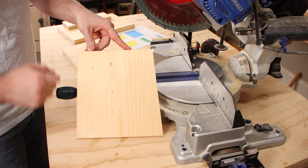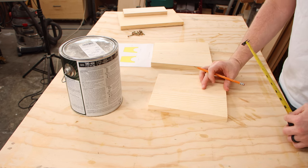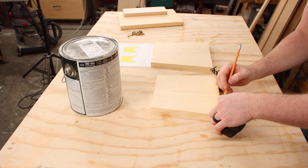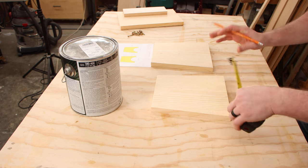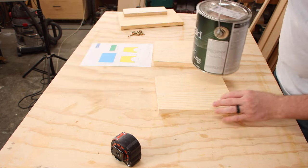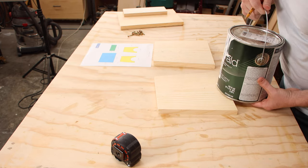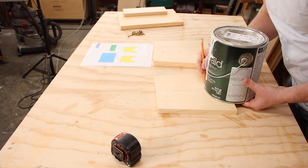So there's the taper on our leg. We want our half circle to be about six inches wide and three inches high — that's an inch and a half from each side. These are just general guidelines; you don't have to strictly adhere to this. It really depends on what you find to trace your half circle with — I'm going to use a paint can. I'll line it up on the marks as evenly as I can and then trace our half circle.